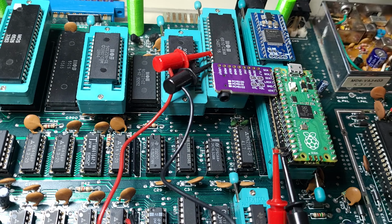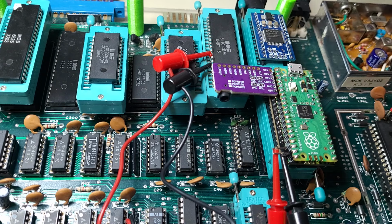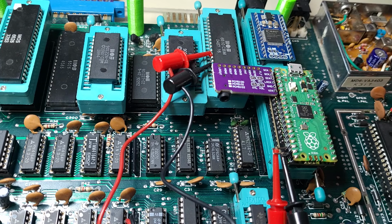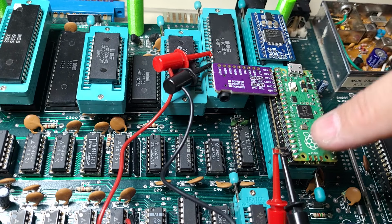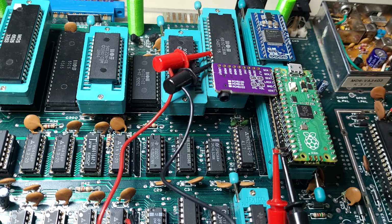Those dots actually go to one of the pins on any one of the different ICs here. So if you take a multimeter or look at a schematic, you'll find which pin from the CPU goes with what little pad on the board. And what you can do is just solder in one pin on these two pads that correlate to those two pins, and then just have a jumper cable going from these two to each one of those pins. So you might have to just solder the one pin in. But it's relatively simple. Okay.